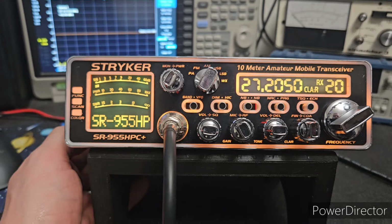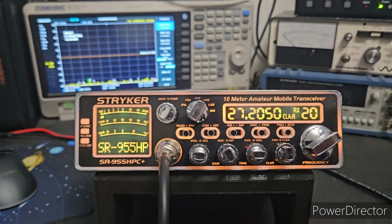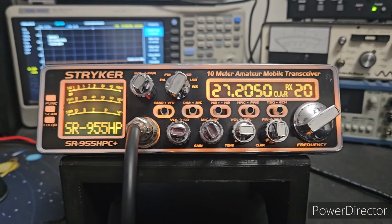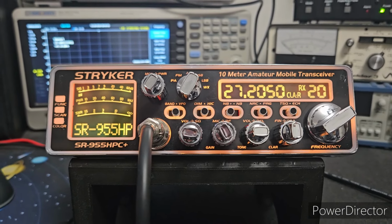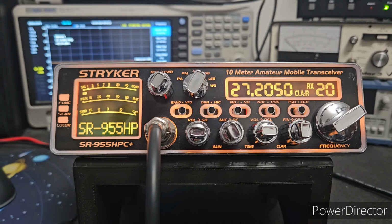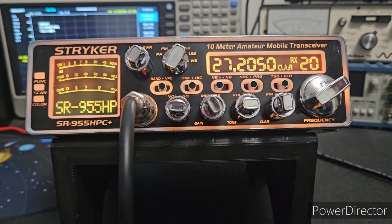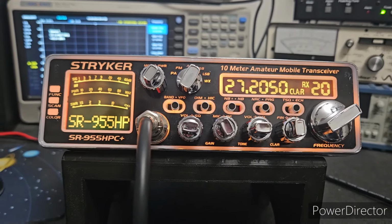It's better for the radio operator to not have as many concerns about bleeding over frequencies and causing unnecessary interference and just everything in general. So that's why I do what I do here. If you don't agree with it and that's not your thing, that's okay. If you just have a power meter sitting in front of you and you're just tuning for max power, then that's all you can do. But I guarantee that a radio like this is going to out-talk yours, because yours is sending out more power off the frequency than what you're on, and that doesn't help you at all. The power meter likes it, but staying on frequency with your power is important, and that's something I highly stress with what I do and what I've always done.